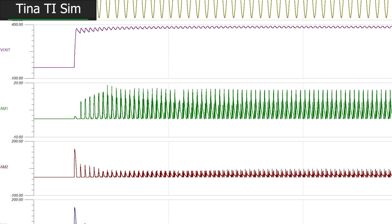I'm not really a fan of these simulation models. The controller is missing a pin based on the data sheet, and the ideal boost stages feel a little hand-wavy. I'd really prefer to run a true transient simulation rather than use models with so many assumptions. If moving forward with the UCC28070 controller, we need to learn more about this part — I'll be getting in touch with TI's apps engineers or finding a suitable replacement. If the current waveform we're seeing is really what this controller generates, we'll be much better off with an offline switcher at significantly reduced cost and complexity. And if a true power factor corrected input is required, I think we'll need to roll another control loop on a microcontroller — we've already got two of them, so what's one more?